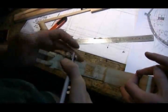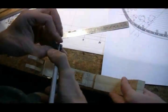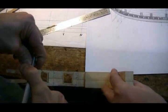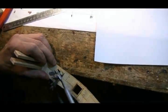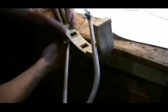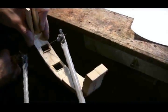Okay, he marks the inner side of the hull first. Yes. And so, actually, when we cut them out, we try to keep this angle more or less, not exactly, because we will then adjust it with the frames, right? We make the cut not exactly, on the eye angle only. Okay, so later we shall adjust the necessary angle with the help of the frame pieces. So he's cutting on an angle, you can see he's not cutting straight like that. Yes, he's cutting on an angle like that. We can change the angle.